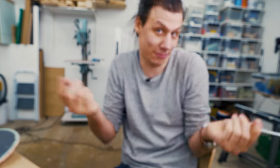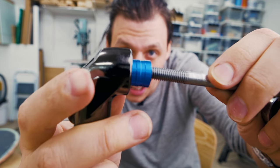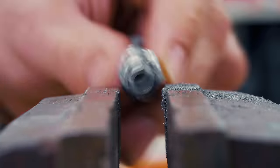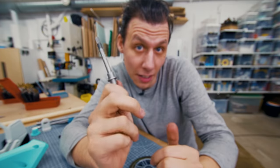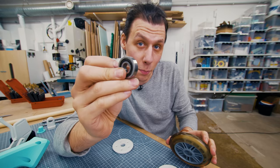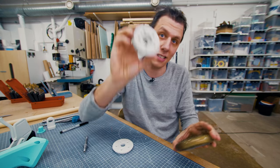It works! And yes, I could have used my newly restored vice or my fancy milling machine, but this worked. The last thing I need to do is to be able to drive it with this angle attachment for a drill, so I need this shaft to attach to the inside of it. I'm just going to file a hex just like on the back side here so it goes into the hex hole. Now we have a hex at the end — I could have used the fancy machine for this as well, but filing worked just great. This thing now fits in here, it even locks in place — that wasn't intentional but I'm not complaining. So to get this big bearing inside the wheel I want to replace the center section with this 3D printed part, so I'm going to cut this out and then install this instead.